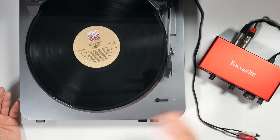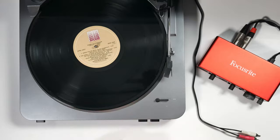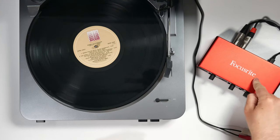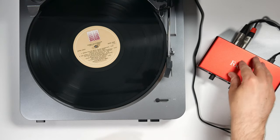You're going to need a few things to do this. Obviously you're going to need a turntable — in front of me I have an inexpensive Audio-Technica turntable. I also have something called an audio interface; this is the Focusrite 2i2. To do this you want an audio interface that has two line level inputs. This is why I recommend the 2i2 over the Focusrite Solo — this way if you have a stereo device you can plug both left and right inputs into your audio interface.